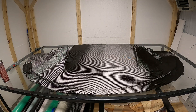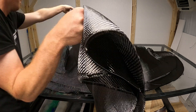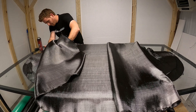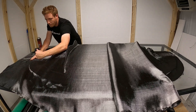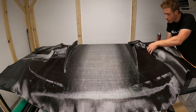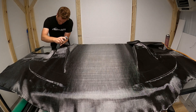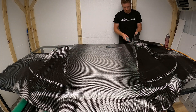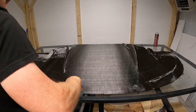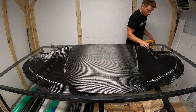I was just a little short on carbon fiber in one area, so piecing a little piece in. One more layer - this is the 3k - kind of for looks, still adds strength but just a nicer looking weave. Using the 3M adhesive again, trying to get the carbon fiber to lay into those pieces nicely and not too many wrinkles. Make sure you press down all your edges and get everything sitting nice the way you want it. Vacuum up all your little strands so they don't end up in your part.